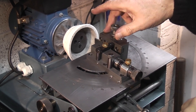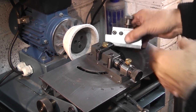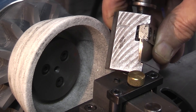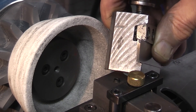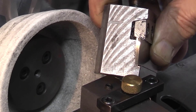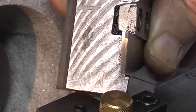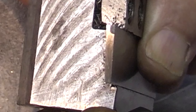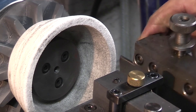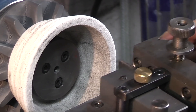You will get some dust and grit around the wheel, but it's not too bad with a single job. If I was doing a lot of grinding I'd have the vacuum on to remove the dust, or use a mask. You can see on that tool face it's following the original grinding. On the left hand side it's gone right to the top but on the right hand side at the top it looks black — there's no material there — so I still need to grind more off. All I'm doing is holding it up against the fixture set at the right angle and moving it backwards and forwards.